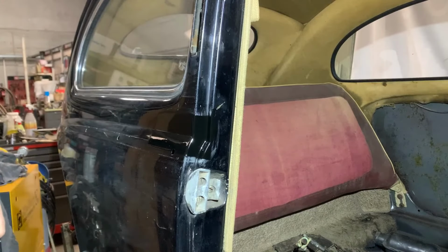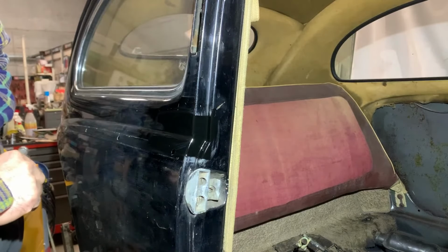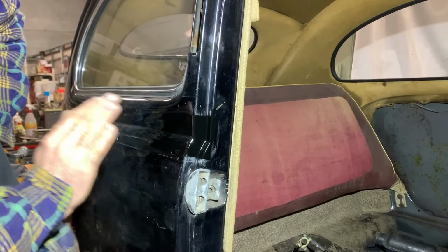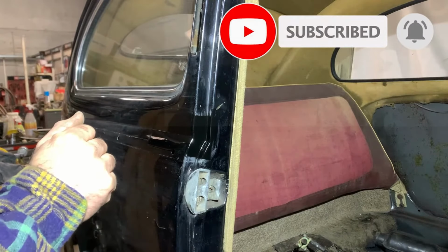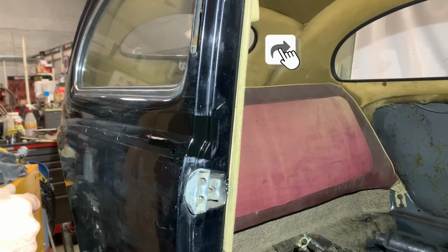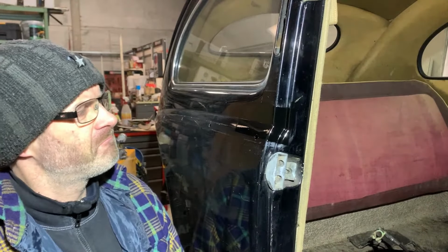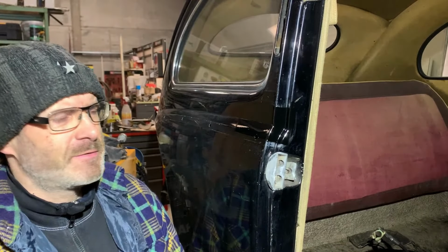This is painted now. It will have some debris in it, yes, but I can buff it all out, and where the paint went a little bit further, that's okay, I can buff that out also. If you do that with a little bit of sandpaper, very thin, 3000, 4000 grit, then you can take that out, even all the rest here. I have to clean that up with detailing, so it will look very nice again. So this is done, and I'm very happy with the outcome. So yeah, the rest is detailing.